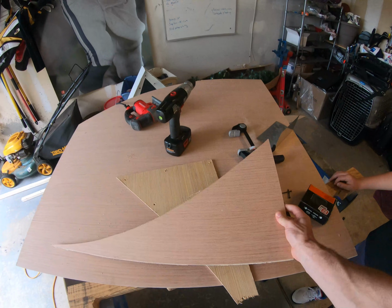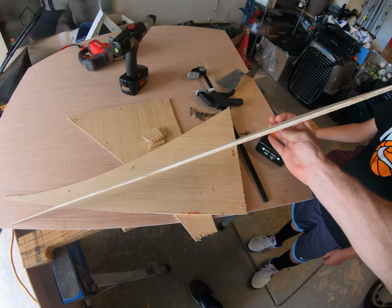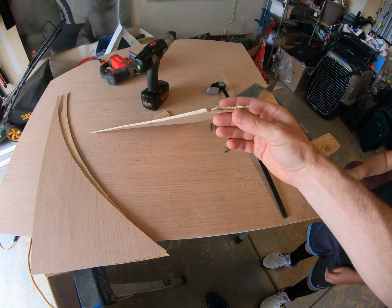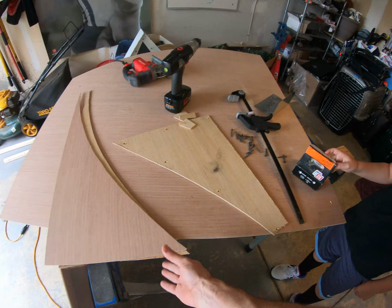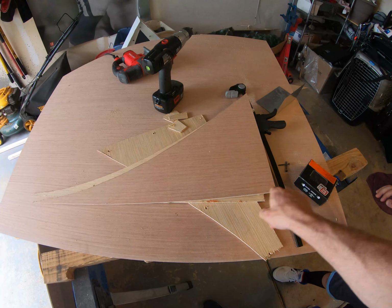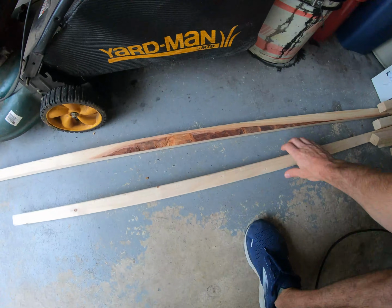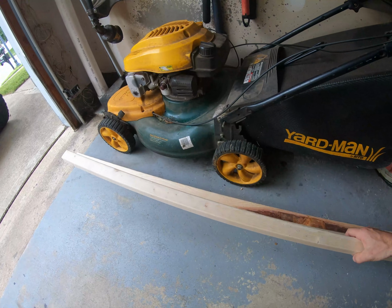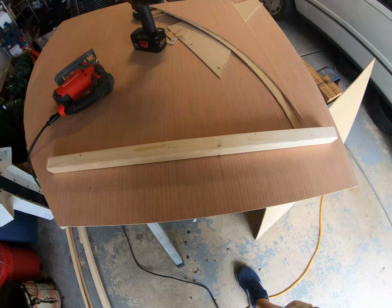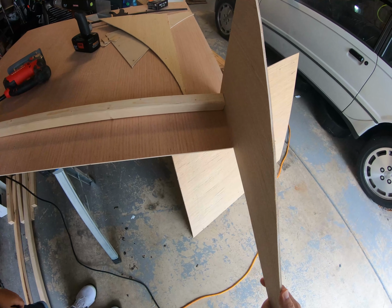We have our two sides cut, very thin. We've experimented with this, as you can kind of see here, to see how much abuse it can take, and it held up pretty well. But basically, we've got our sides, 16 inches, 32 inches, and then we've pre-cut. Basically just went to the hardware store and got 8-foot 2x2s, and we pre-cut those to basically fit in between our sides.